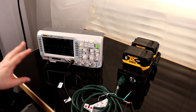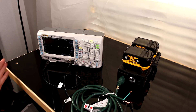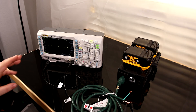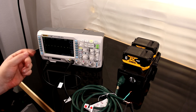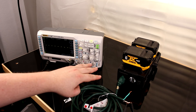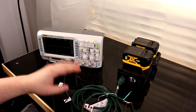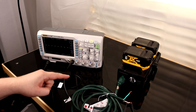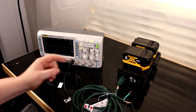Sine waves are very important because most AC devices are designed to work with that wave. When I plugged in that soldering iron station, I noticed there was a tick, tick, tick sound — and that's what this square wave is causing. This is not going to be great for sensitive components, but it will work for some components. If you just need power right now, this is a perfect solution, but I don't think I would plug that soldering station in here a lot.